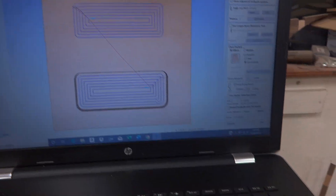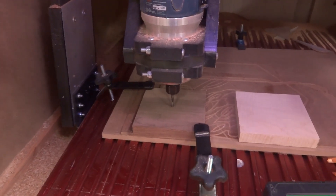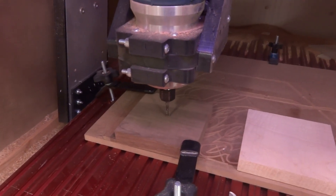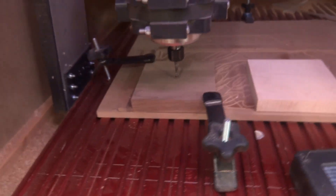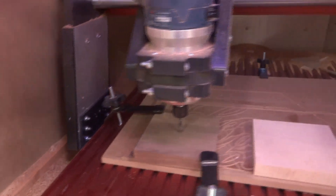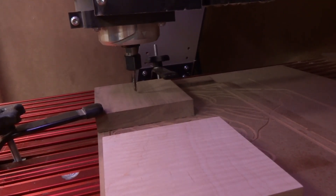I've already got everything on the flash drive and over to the CNC. The first thing we've got set up here is our walnut. We've got our controller here, we'll go ahead and select our program, which is the upcut test. Like I said, we are using an upcut bit. I have my router set for full speed, so that's 25,000 RPM. We've got everything zeroed out and set, so we'll go ahead and start the machine and start our cut.